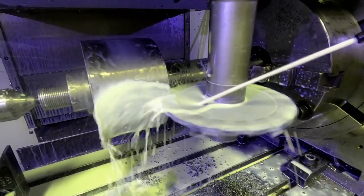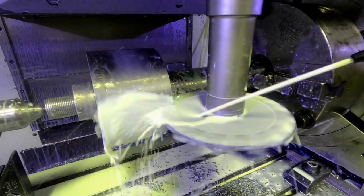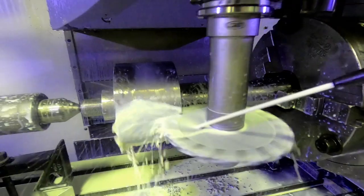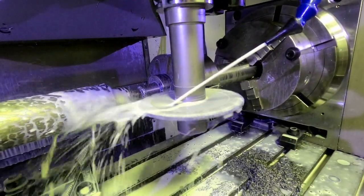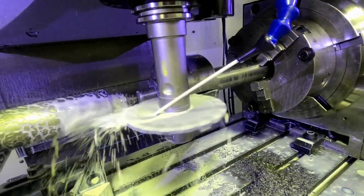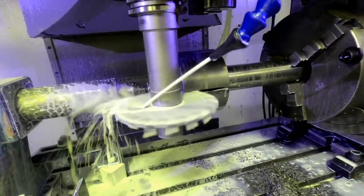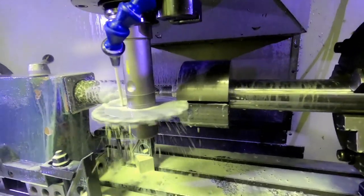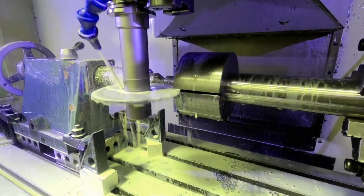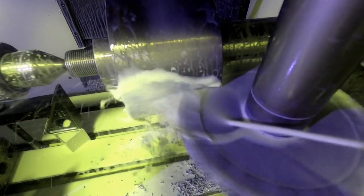We do this in two different saw passes. So to start out, this is our finisher, but we use two of almost the exact same saw. We use one saw through. It usually goes in two passes, one up a little bit and one down a little bit from center in order to cut that slot almost to size and almost to depth. Afterwards, we put in a finish saw.